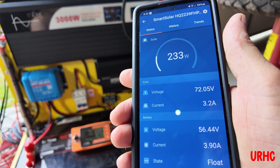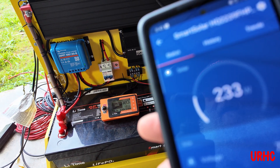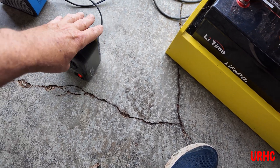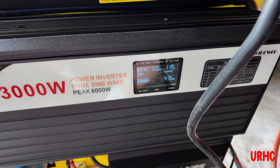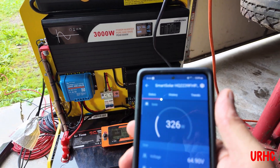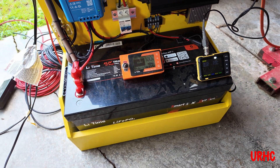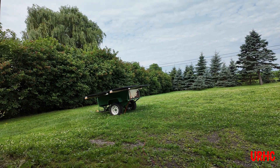I'm using this right now to gather data. I've got two 440-watt panels but it went overcast and cold, so in the morning with no sun you're not going to get the full wattage. The load is drawing 450 watts and I'm only getting 326–327 watts from the panels right now because it's early and it's going to storm again. When they're in full sun, they do do well.